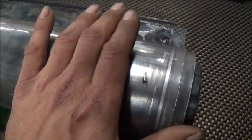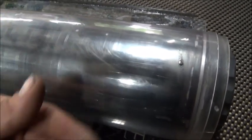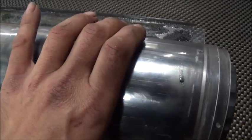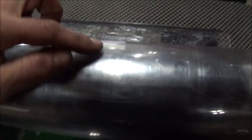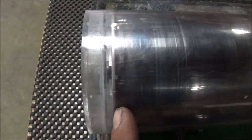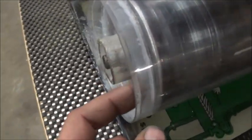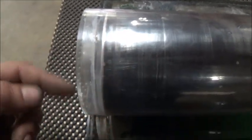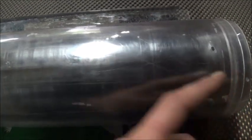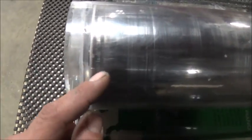We're going to force compressed air into this sleeve. How a Tesla turbine works is by forcing compressed air or steam around a very narrow corridor between a spinning shaft and a case. You create a positive pressure zone and the air will actually wrap like a tornado all the way around that cylinder, touching the cylinder many, many times as it goes across — a lot like a turbine without the blades. Once the air gets all the way down to the end, there's a gap between the case and the end of the drum; the air comes across, drops through that gap and into the inside of the drum, creating a negative pressure zone.